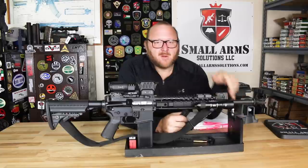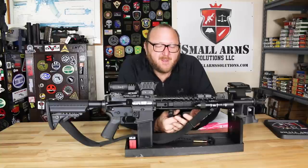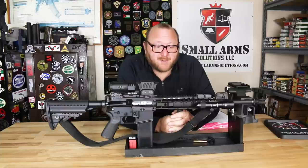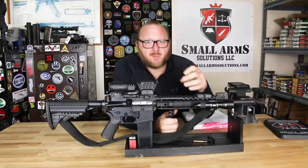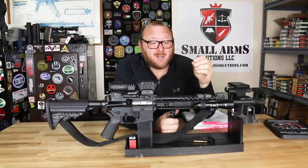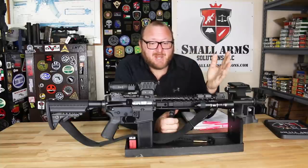The Cold Hammer Forge process, I believe, is a more durable and longer-lasting barrel than the standard button-rifled barrel that you see on a standard M4. As far as accuracy is concerned, it's been my experience, and the experience of many who've really looked into it, that the button-cut barrels give you a little bit more accuracy, and you see that more on a bench condition. You wouldn't see it in a combat rifle, really, because you have a sharp leading edge on the rifling, which engraves on that bullet and gives you slightly better accuracy. You really have to take out most human error and have match ammunition to be able to see it. In the combat rifle, you generally won't see that.